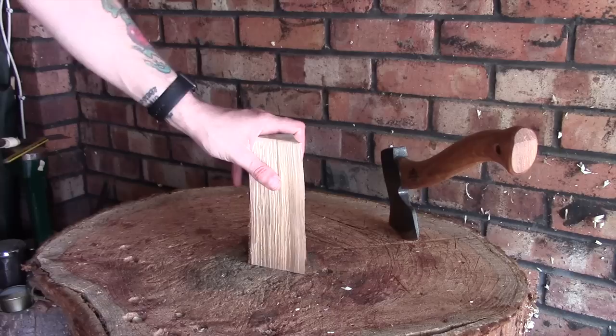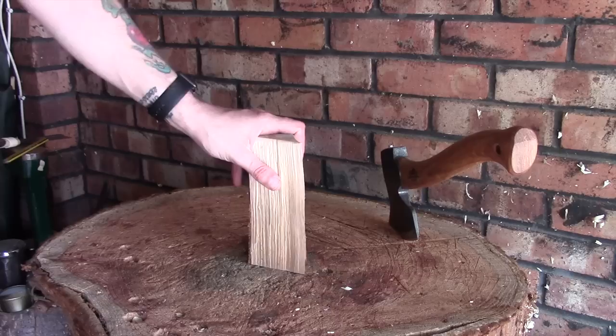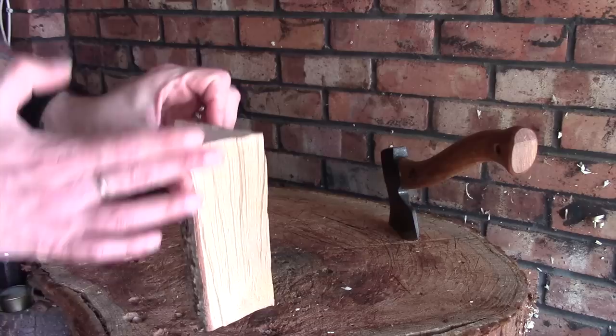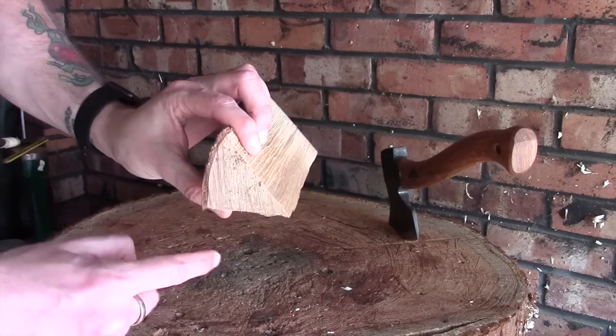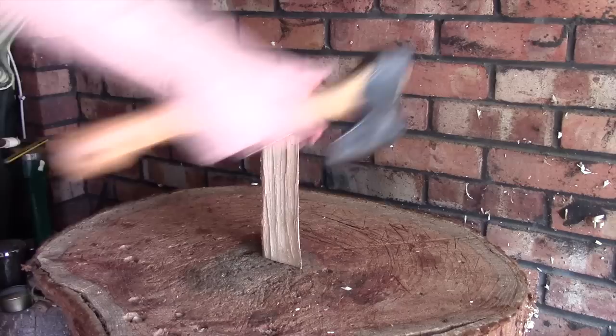Here is our billet, and what we're essentially looking to do is to turn this from a triangular section from a piece of log. All I've done is taken a standard log and split it down a few times to get this billet. What we want to do is take off all of the corners and get something around about a square rectangular piece from about here to about here. We could start carving down like this, but actually the quicker way is to come straight down across the top.